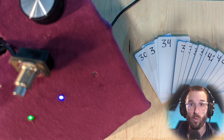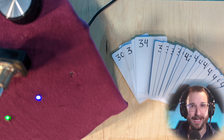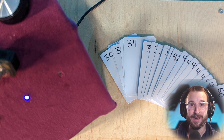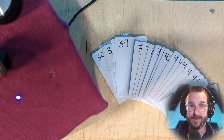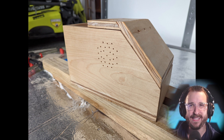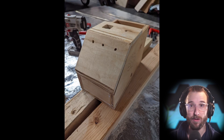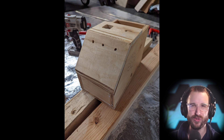The machine reads the number from the card and plays the corresponding file. That leads to the second point for using a Raspberry Pi: storing the audio files. With an Arduino, I would have needed an SD card, which is not required with the Raspberry Pi. Third, the Raspberry Pi runs an operating system, making it easy to use Python scripts, services, and a 3.5mm auxiliary output for the speakers. Fourth, the Raspberry Pi can power an external speaker via 5V USB, so there is only one cord going to the outlet without an internal power supply.